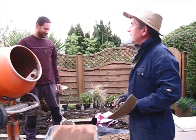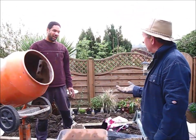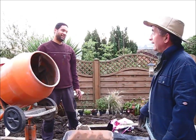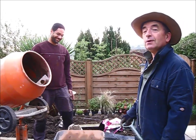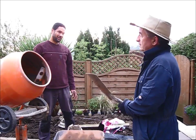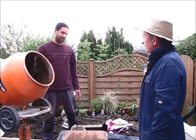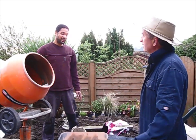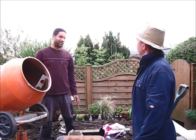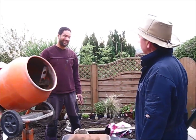So we are making up the mortar. Is this cement or concrete? I'm putting cement and sand together — the man says it's a mortar. It's sand and cement, about four shovels of sand to one of cement. Is that a strong mix? That's a strong mix — a five to one would be adequate but we want to make sure. Quality.